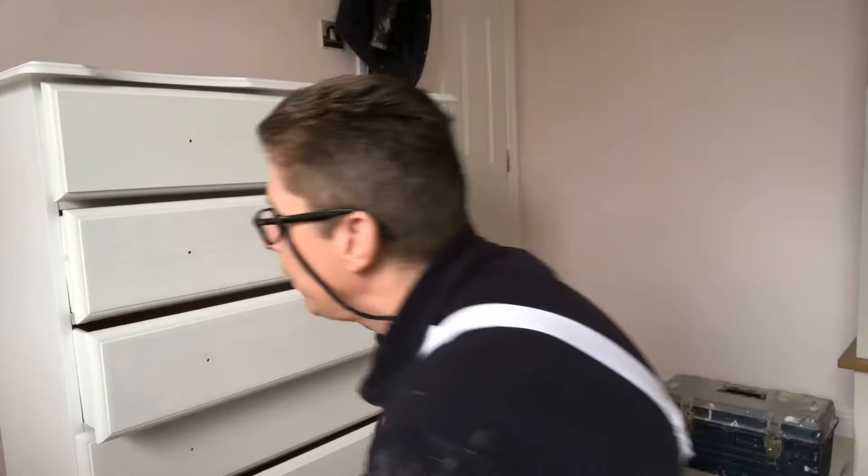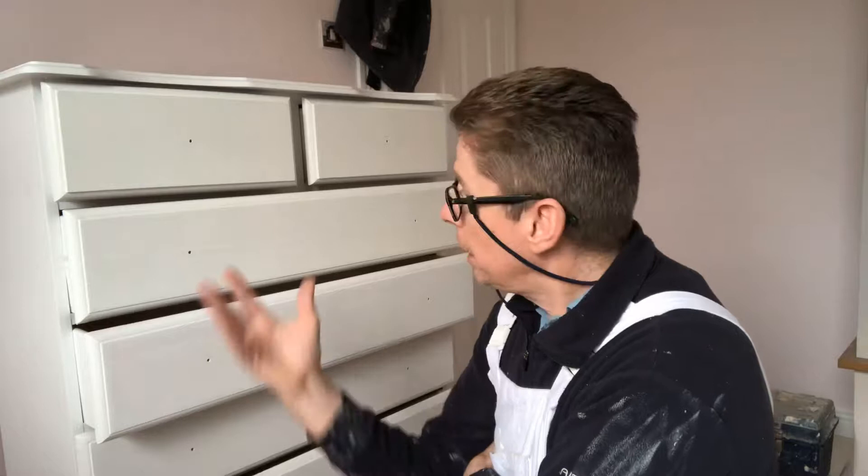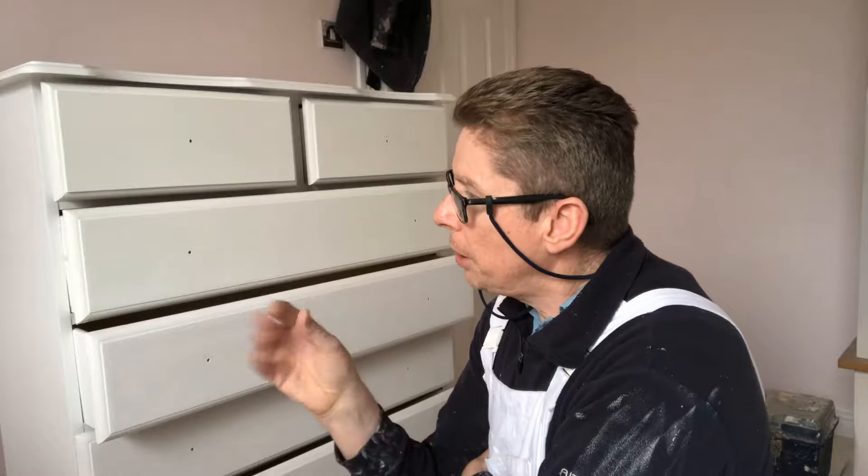The whole idea is I don't paint the kitchen in place — I like to take all the doors off so you can get at these wee edges. It's neater, tidier, and easier to get at. So if you're doing any units, take all the drawers out first, run them quickly, take them out, clean it all down with a degreaser or sugar soap or whatever you have, give it a good clean, take all the handles off. These two cabinets were done in a warm cream colour previously, so I had a lot of preparation done — they'd all been primed. All I had to do was clean them down, give them a light sand, and give them two coats of white.